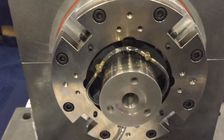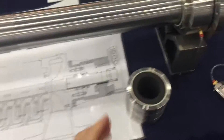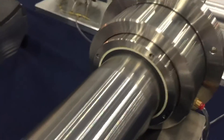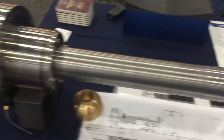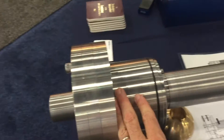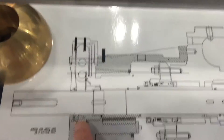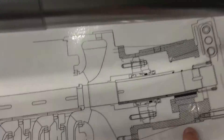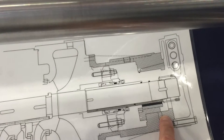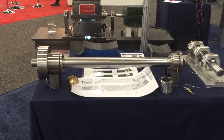At the demo for pump gas bearings, you can see we're using a 360-degree bushing technology to support the shaft. That bushing would be like the one you see on the non-thrust end, and at the other end you've got a thrust bearing and a journal bearing. These components bolt right into a standard pump — here's your thrust bearing, here's your seal cartridge, here's your impellers, and here again is another radial air bearing. These are bearings that are directly retrofittable into pumps, eliminating oil in pump applications.